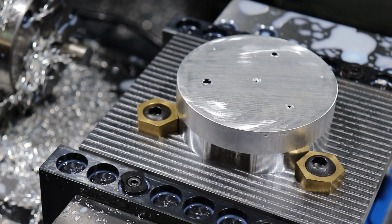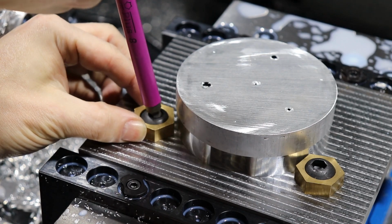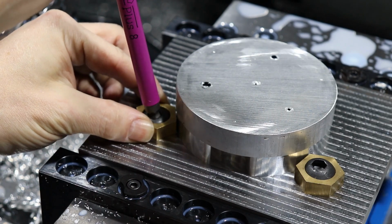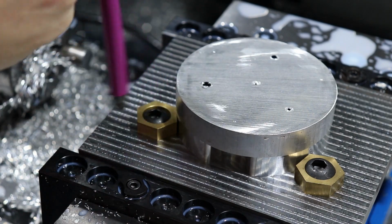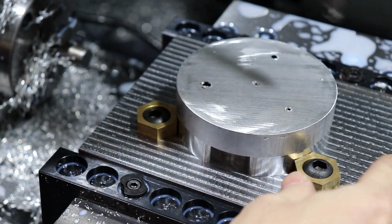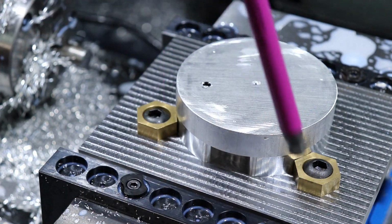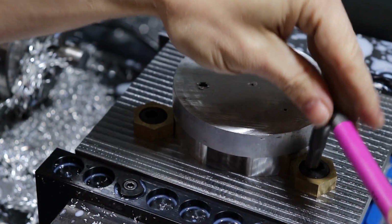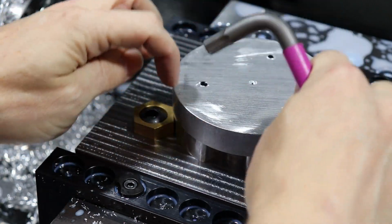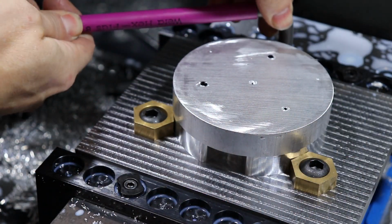to hold it. So the way these clamps work is they have an eccentric cam that makes it advance when you turn it. So that'll hold it down. And I'm just tightening those all down. That should hold it in place pretty well. They don't really do much for holding the material downward, but as long as I tap it down, they should hold it in place well enough.